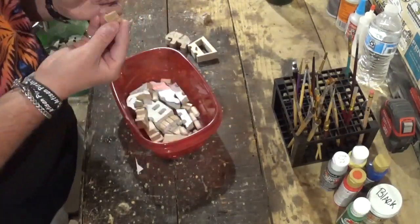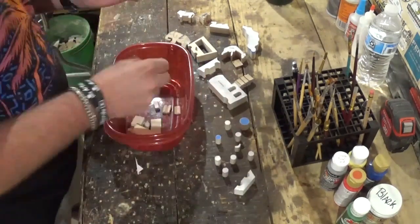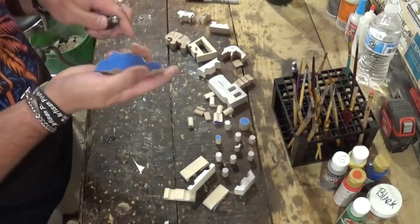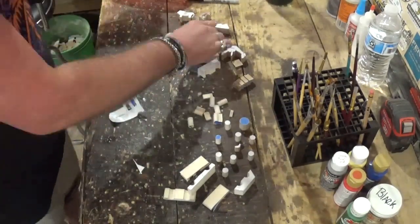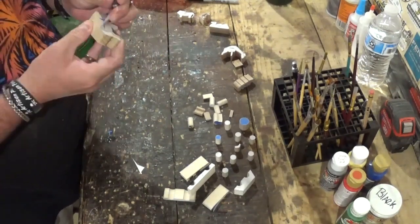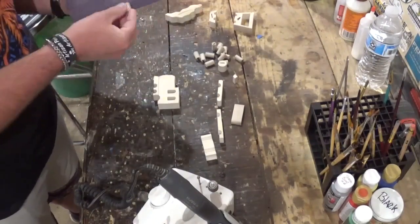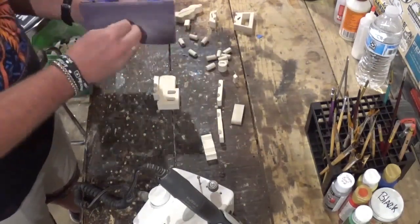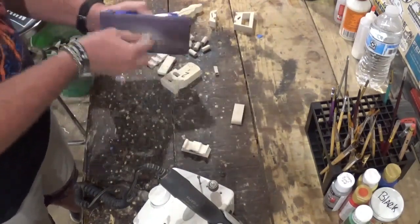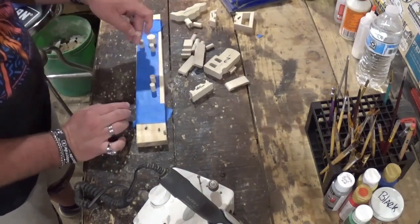Now I'm marking with a Sharpie which side of each piece will be glued down, just as a visual reference. Then comes the tedious process of peeling off all the patterns — it felt like it took longer to peel them off than it did to do the actual scroll work. After all the pattern is peeled off, I use a sanding pad with 180-grit sandpaper to quickly sand everything, and then my marathon rotary tool from Bare Wood Supply to shape and contour the pieces. I only contoured the train cars and the train itself, not the animals.